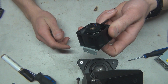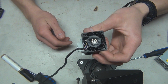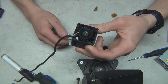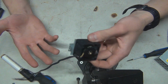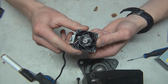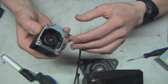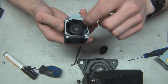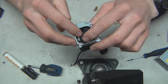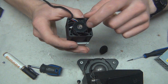Hopefully these bearings were just a little bit dry in terms of lubrication and not actually literally worn down and screwed, because if that's the case, then this basically was pointless. But hey, we got to see the inside of a server power supply, and I'm thinking this will help with the noise at least. I actually didn't record the noise before, but essentially it sounded like a very faint, almost like a piece of paper was hitting the blade of this fan. So it could have been a bit of dust, but it was too erratic. I believe it was the bearing here.